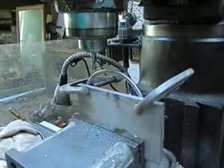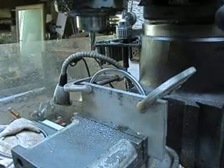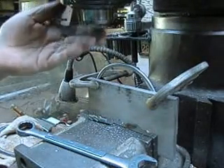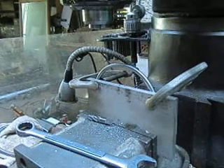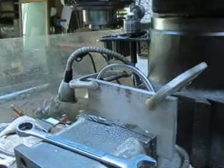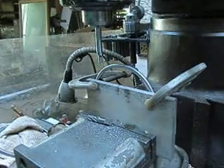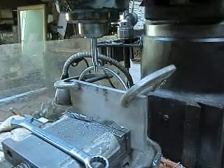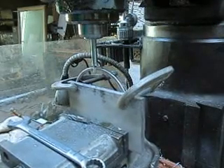We're out all the way here. Let's find the wiggler. It really doesn't have to be that accurate, but I like being accurate, so I'll do it. Drop it down, crank it up, bring it in until it kicks — there it is.